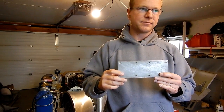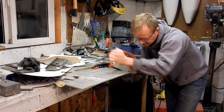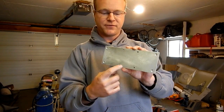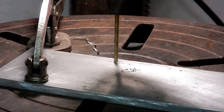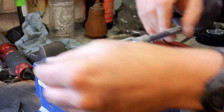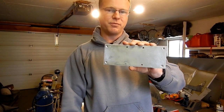I've made my little mounting plate for the bridge rectifier. I basically just cut this piece out of a chunk of quarter-inch aluminum plate — with an angle grinder, not a hacksaw. Then I drilled and tapped four holes to accept 10-32 screws to mount the bridge rectifier, and drilled and countersunk holes to attach this to a couple of wooden blocks to act as a base.